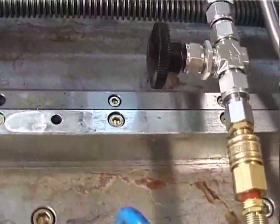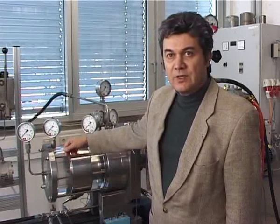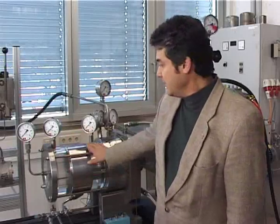The gas accumulates in the area of the can and forces the liquid out of this can, thus obstructing the circulation of the medium through the bearing arrangement. Consequently, the area of the sliding bearing can suffer damage, which we are now able to see.